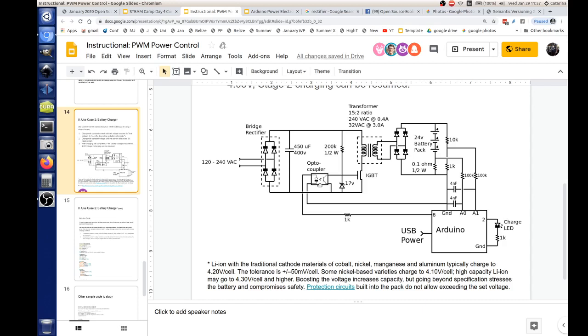Cool. That's a necessary step. I bought one of these opto isolators for this as a test, and it's just a little bitty thing, and they're cheap. You're protecting the Arduino from getting fried by that voltage there. The transformer is what gives you isolation also. Yeah. The transformer isolates the power over here, and this isolates the signal.